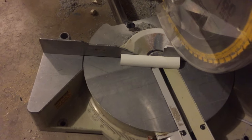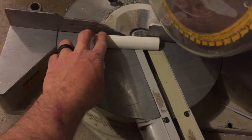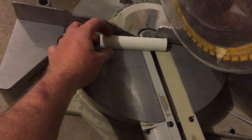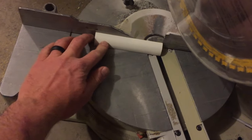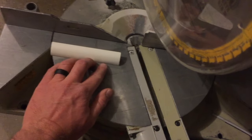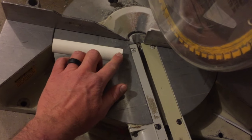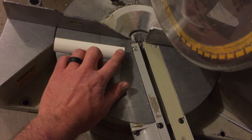Okay so we're back out at the saw. You can see this is the length that I'm going to need. Be very very careful when you're working with these small pieces — we're going to be using some support blocks to really make this cut correct. With the same side down on the quarter round I'm going to need my 22.5 degree cut on this end.